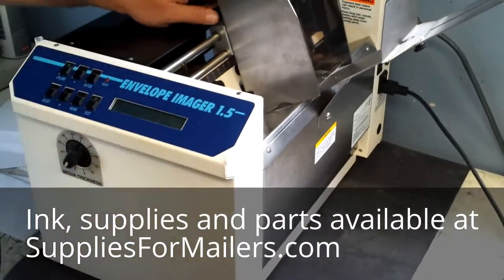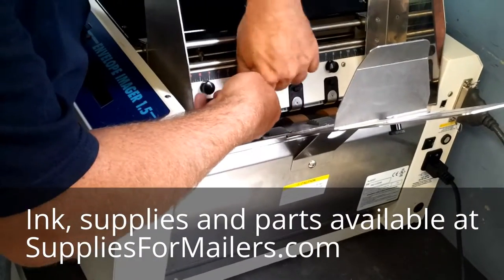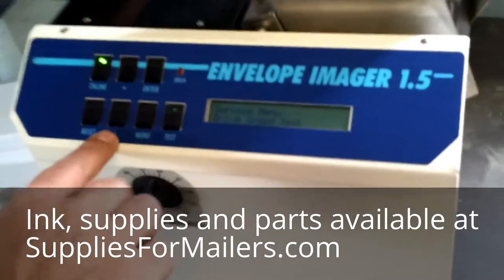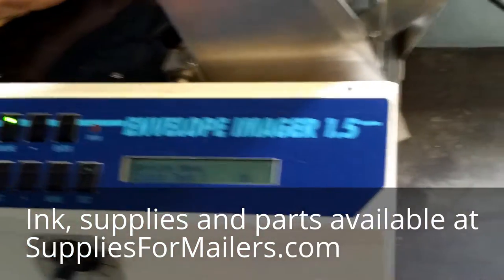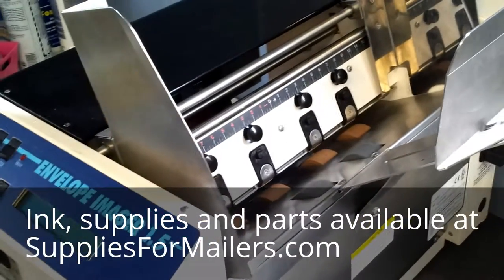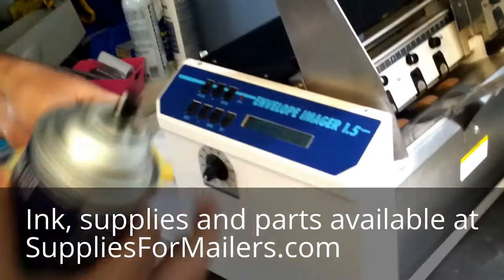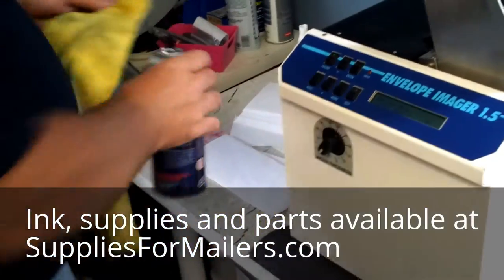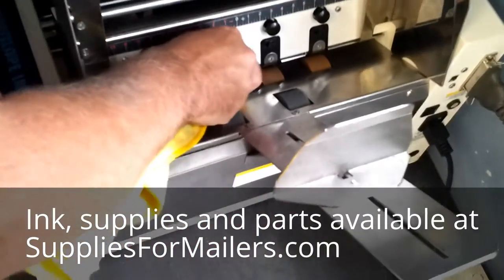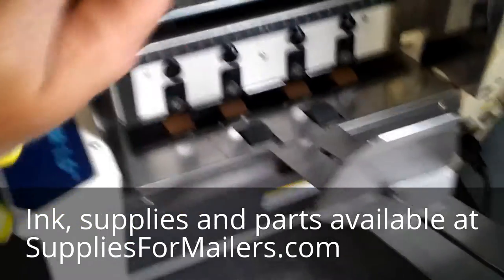For maintenance, you can slide the side guides out and lift your separator tips and lock them up. Go on here and hold down the test button, then hit the plus until it comes up to clutch test, and hit enter — this will have your wheels spinning. You don't want to spray directly on the wheels. Just take a little rubber rejuvenator that we sell in our store, spray some on a rag, kind of ball it so you don't get it down in the machine, and just rub across each tire. And that's about it for cleaning the wheels.